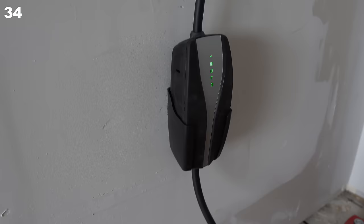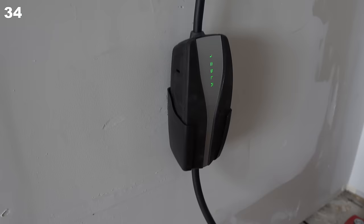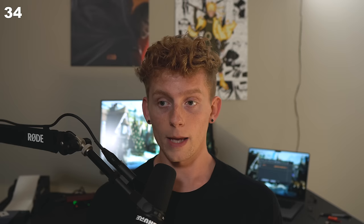If you're planning on buying a Tesla and charging via a normal wall outlet, don't. Level 1 charging is inefficient and it sucks. Want to get the most bang for your buck with home charging? Skip the Tesla wall connector and get a NEMA 14-50 plug — they provide almost the same speeds but at a much lower cost.